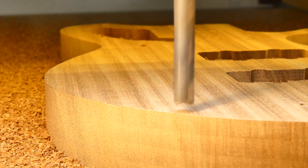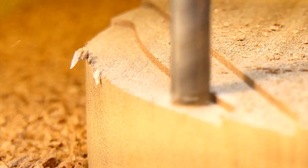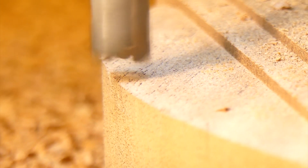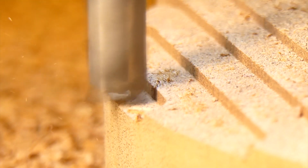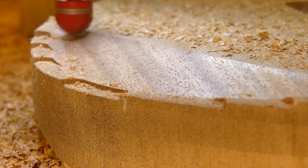When it comes to reattaching the part, or in this case, as no workholding was necessary for the first operation, attaching the stock to the spoil board for the first time, I use relative coordinates exclusively. In relative coordinates, you index the X, Y, and Z axes in relation to the part, instead of relying on the origin of the machine. In this way, I can attach the part with the center line of the stock.